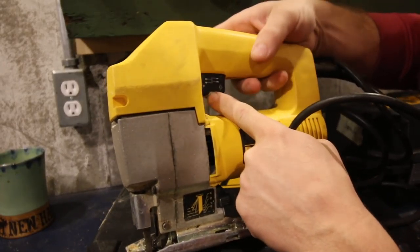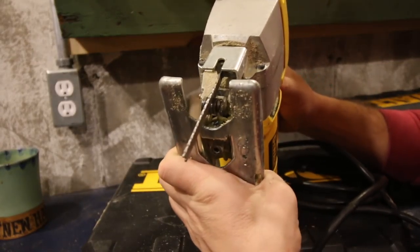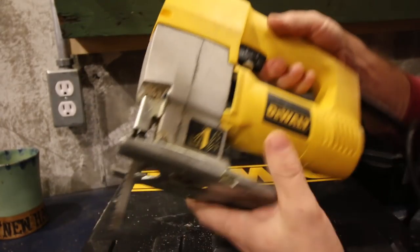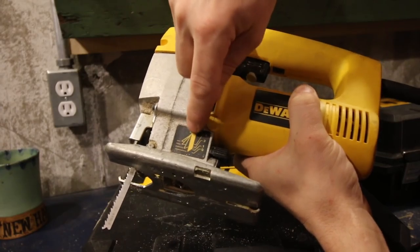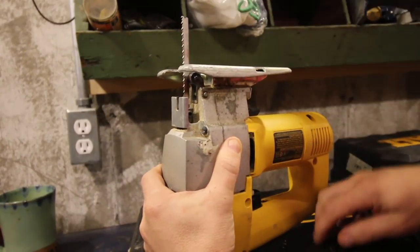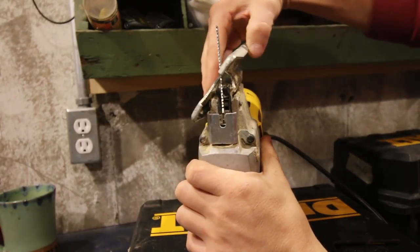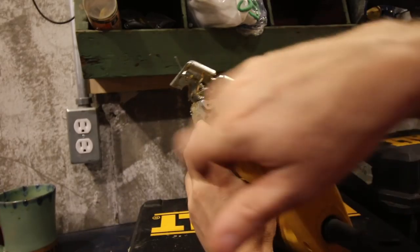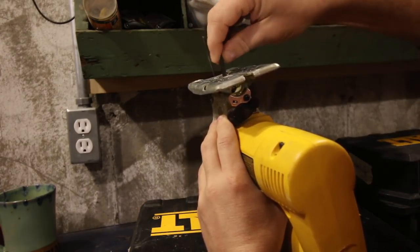This is a DeWalt variable speed on the trigger, so you can make it go faster or slower. The plate you can tilt and angle if you want to make a 45-degree cut. You can change the direction of your blade. If you move this lever right here, it shows you the positioning of the blade — it can kick it forward. On the DeWalt, it comes with the Allen head wrench. Loosen up your bolt and it frees up your plate so you can make your adjustment for your angles. It's got a little gauge on the back to let you know what angle you're on, then you can tighten it up when you're on the angle you like.